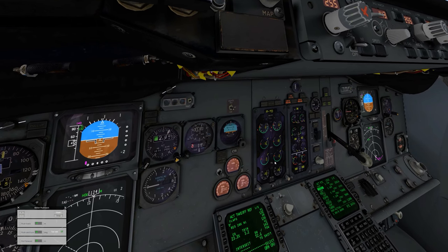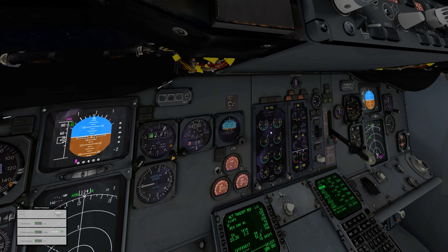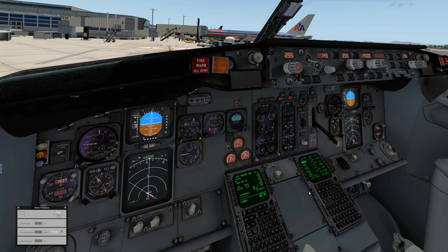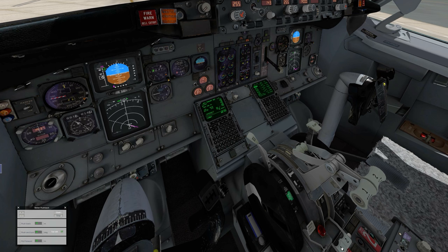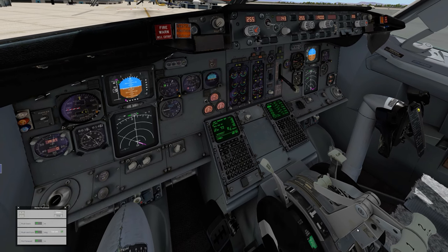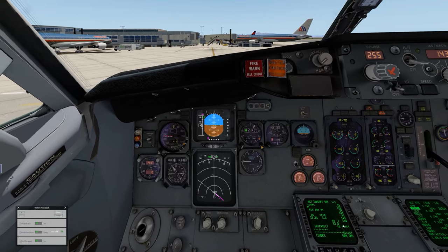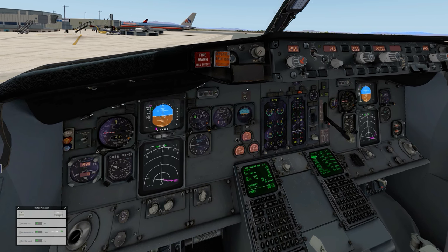Just going to monitor. And two. Oil pressure. It's very good. And then N1 rotation is also observed. And we'll wait for 25. It's 25%. Start the clock. Looks like a good light off. Start cutout. About 20 seconds.